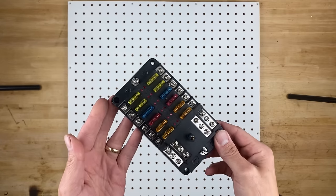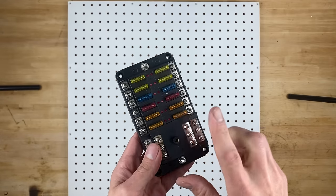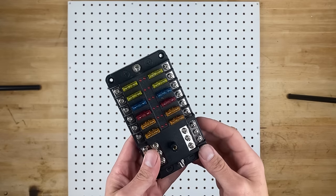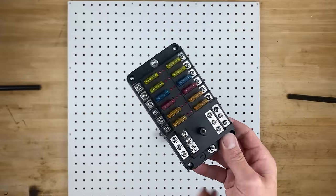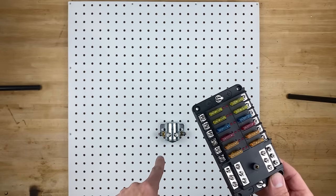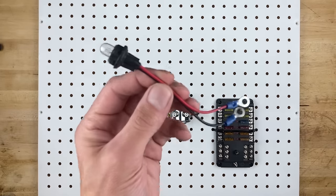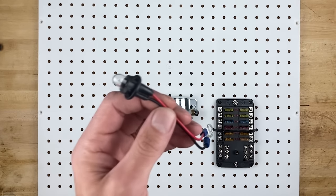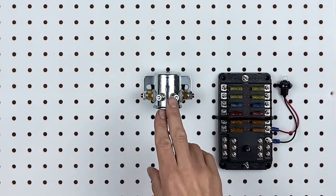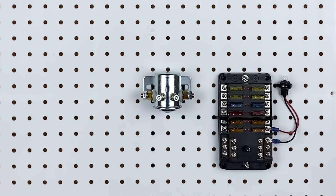This right here is a fuse box. There are much bigger fuse boxes in the world and much smaller ones as well. You can also get fuse boxes with little tiny fuses or really big fuses — there are like a million different options, so you've got to pick the one that's right for you. I grabbed this one because it was cheap and it allowed me to show you how to wire out that solenoid to power up this fuse box. This right here is a simple socket with a 194 bulb in it. I'm going to plug it into that fuse box so that we know when we turn the power on, this bulb will turn on and that way we know the fuse box is actually working. We now have the solenoid attached to the board right next to the fuse box and the 194 bulb attached to the fuse box, so now we need to actually connect these together with some wires.